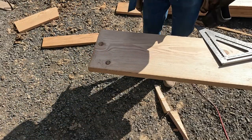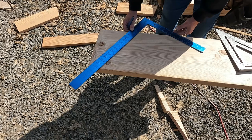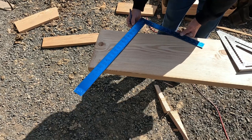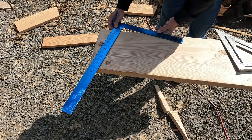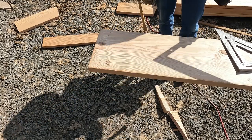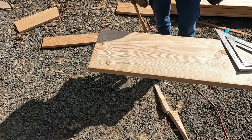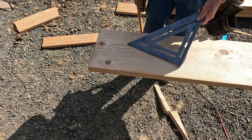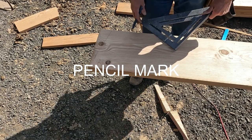With the framing square you go off this side here — run your three here and your 12 here. Sorry about the shadows making it hard to see. There you go — that's with the framing square. I'll cut those and get them out of the way, then I'll show you how to do it with what we call a speed square. I use the bigger one at this end so I only have to make one measurement, and the small one at the other end.